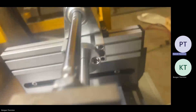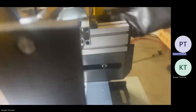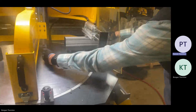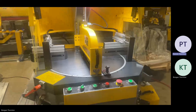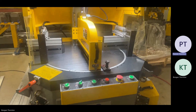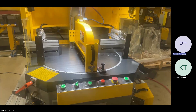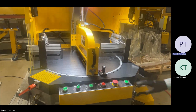The horizontal clamps have adjustment as well. You've got bolts on either side so you can slide the clamps in or out. You've got bolts in the back side so you can open these clamps up wider for wider material. You can also slide these fences in closer to the top clamp. The machine has adjustability if you're doing different size profiles or need to do anything custom with custom jigs — you have the ability to move the clamps in and out to meet whatever your application requires.